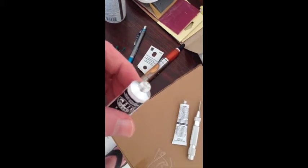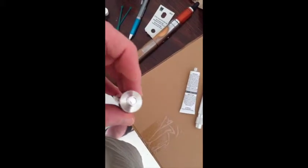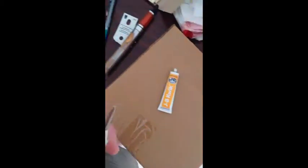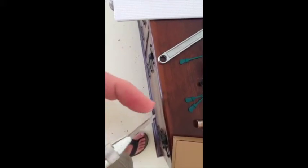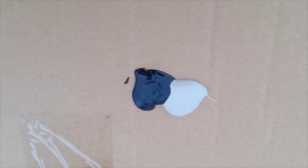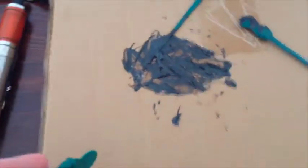Just another note on the JB Weld epoxy — the top of it, you've got to penetrate with something to get it open; it's just to keep it sealed. I'm going to use a punch. The point to make here is with this stuff: you want to get it off of anything you want to keep — get it off of there quick. Keep a rag handy. There are the two little tubes and I'm about to mix it. On the end of my mixing block, you can tell it turns pretty black — the gray mixes into the black and turns into a fairly dark grayish black.